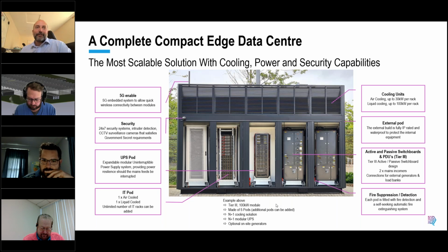Yeah, there are two sides to it, as always. From the Uptime Institute's perspective, obviously I'm not talking on their behalf, but we've had lengthy discussions with them. To be tier 3 compliant on a power perspective, you have to have an A and B power feed into the IT rack, so you can switch one of those feeds off and the IT will remain up. The same holds true for liquid cooling. They insist that you should have separate A and B flow and returns into the rack.